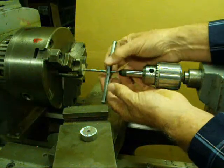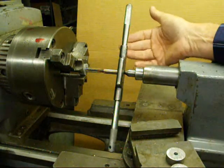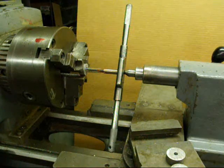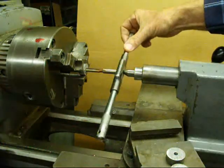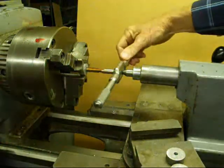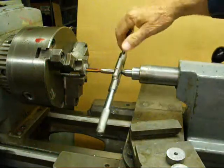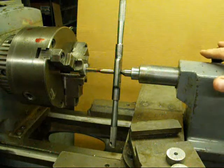Put a little bit of pressure on that. As you get into larger holes, you can use this type of tap wrench or simply use a crescent wrench to turn the tap. We've got the spring-loaded center in there and a piece of aluminum — now we're ready to tap. Anybody notice anything I'm doing wrong? Well, actually I'm not doing anything wrong — I have a left-hand tap. I am feeding the tailstock handwheel with my other hand, then backing it off. The spring center compensates for that backing up and it will continue until you're all the way through. That's why I had painted it orange many years ago.